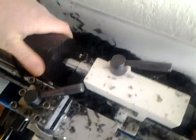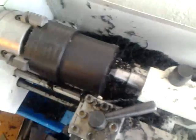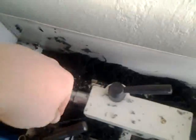We have to clean the workpiece after each pass and remove the plastic foam. It's not a normal chip like you get with metal or wood. Otherwise it tends to rope around the workpiece and interfere with the cutting process.